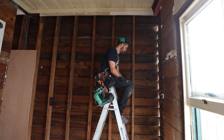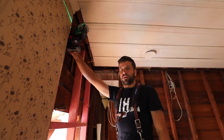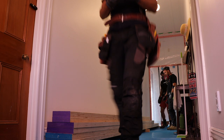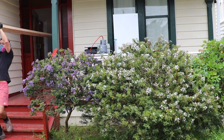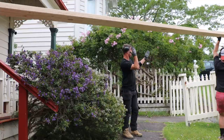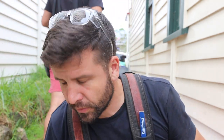Now we're adding in the full stud and the understud. I am setting up this laser to the height of the bottom of one beam and the top of another. These beams are not steel — they are laminated veneer lumber, massive plywood basically. The glued-together timber is stronger than just regular timber, and it means we don't have to deal with steel.